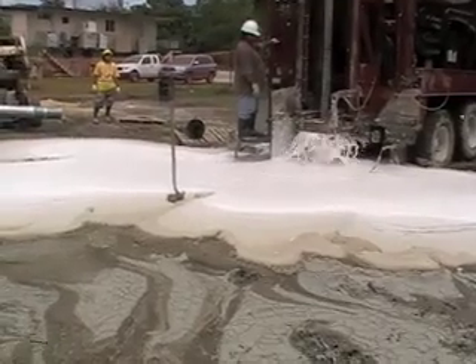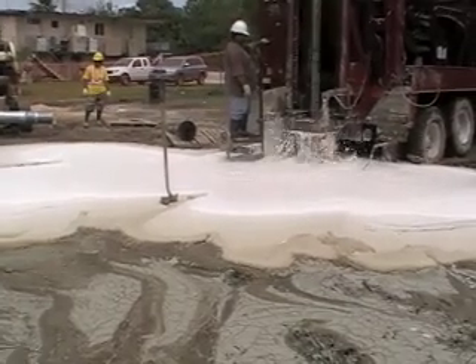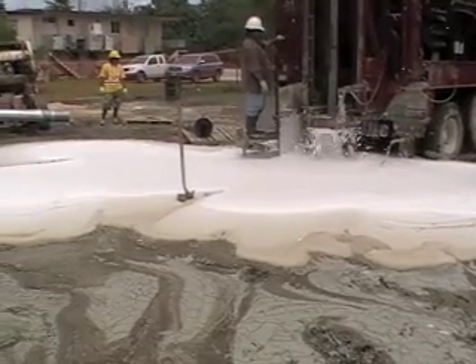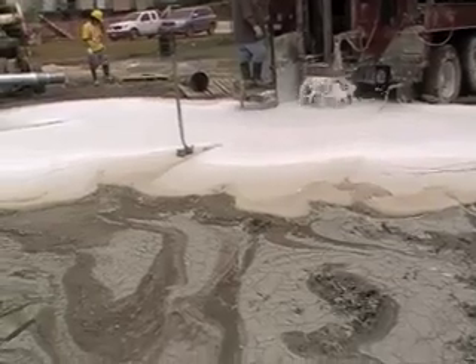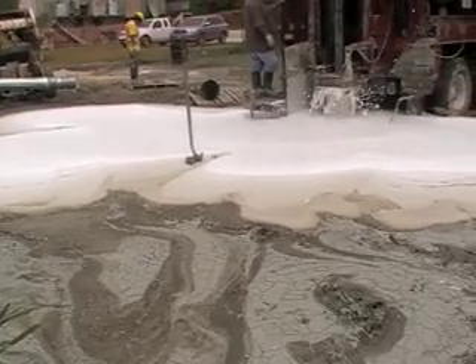What they'll do is they'll drill down eight meters. Actually they'll drill down about four meters first and they'll insert a steel pipe. And then once they get that steel pipe in, they'll drill down the additional four meters and then weld in another pipe and insert that steel pipe all the way down to the bottom of the hole. The reason they do this is because they don't want the hole to collapse in on itself before they put the anodes in.